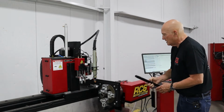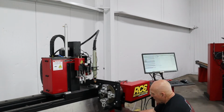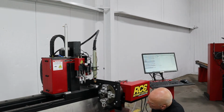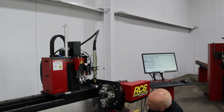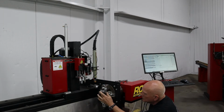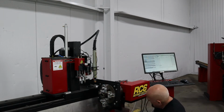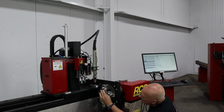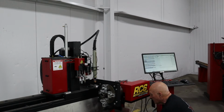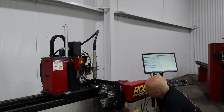So now we're going to raise the entire system. I could do it, by the way, with a couple fingers until I see it contact the roller very slightly. Verifying that the roller has got a little bit of play on it. And what I'm doing is I'm raising a lever and I'm using my fingers to tighten it. Oh yeah, that's real nice right there. All right, I'm going to go ahead and tighten up the lower lock nut, I'm sorry. All right, there we go.